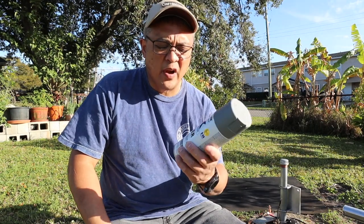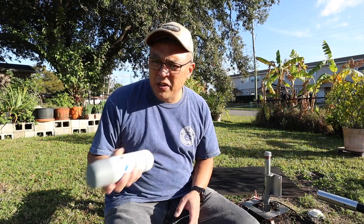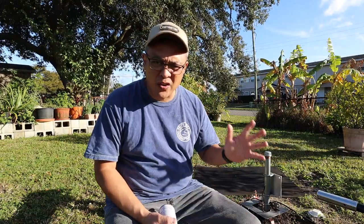I gave it some time for the antenna to dry, and now I'm going to spray paint it. What I got here is just a primer — it's a flat gray primer. I'm going to show you where to paint if you plan on painting your antenna. You don't want to paint the whole thing, because if you paint the base and the paint runs all the way up to the radiating element, you've just grounded your antenna and it's going to destroy your radio and not work properly.